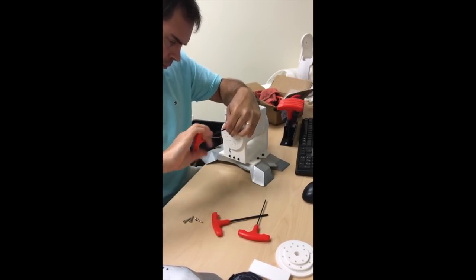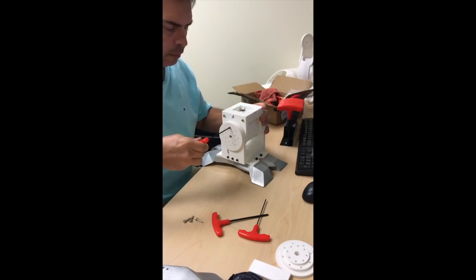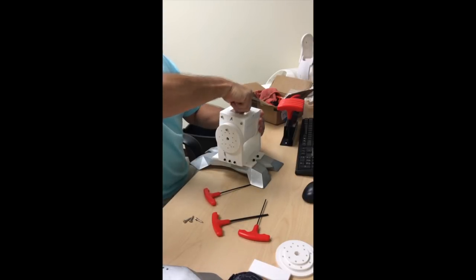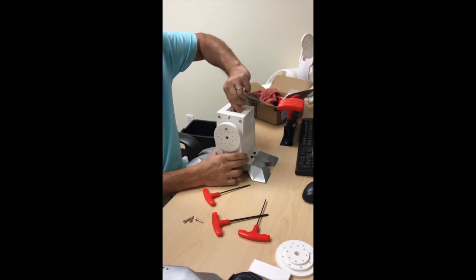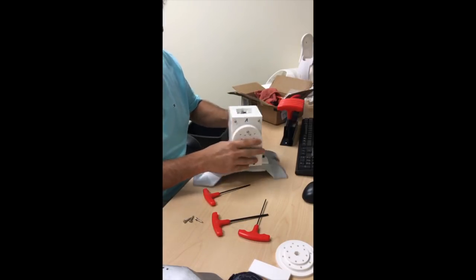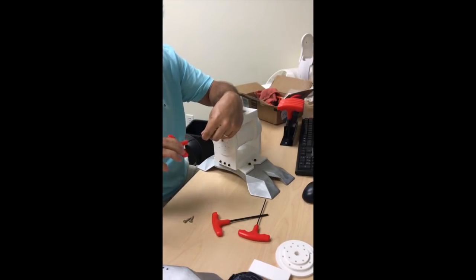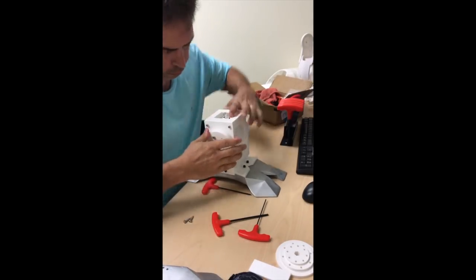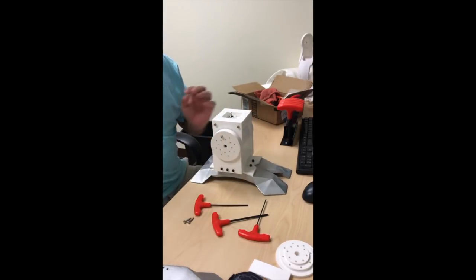So that's why I've created this test rig. Once I assemble the real leg, it's going to be a lot smaller in diameter. I'm going to show you the actual shin itself — it's really just square. This is prototyped based on a six-foot person; that's the goal, to build a six-foot robot. It's 50 to 1 reduction, so I can get very high torque on all three degrees of freedom. I've got a couple of motors, and that's the reason behind the large outer skeleton — it allows me to bring in different motors and mount them on.